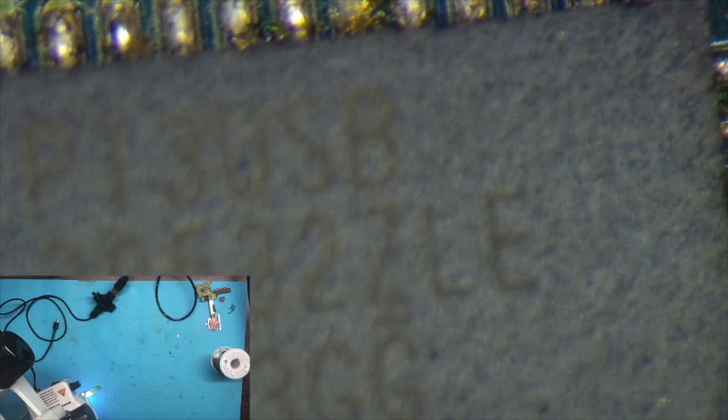I just checked for continuity on either side of the chokes. There are 4 chokes, and 2 lines through each choke. Check the continuity between each of those lines, and they're all good. And usually whenever you don't have video out, one of those guys is bad, if it's not the USB-C port.